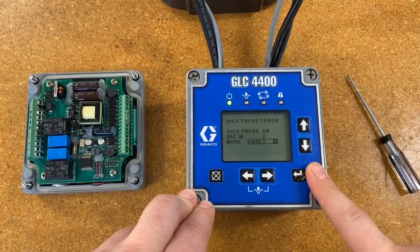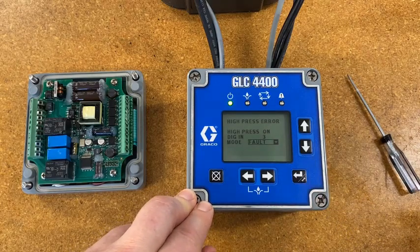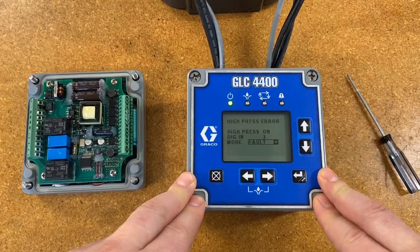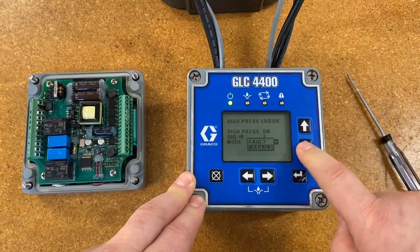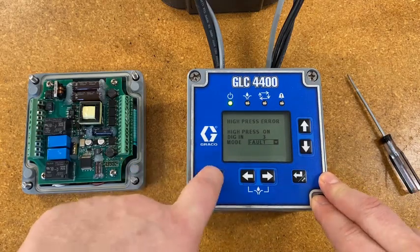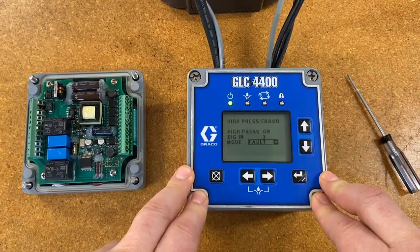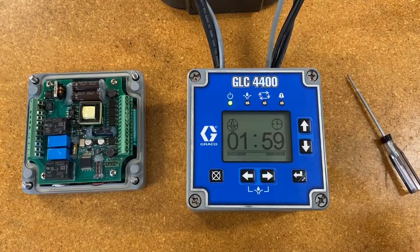We've got three selected, and here you can decide if you want to go to a warning or a fault. The warning is a little more subtle and the system is going to keep working. Typically you're putting broken line indicators on really important, critical lubrication points, so if that line breaks you probably want to know right away and take corrective action. You still have the option to change it to a warning, but I'd suggest changing it to a fault unless the warning fits better into your application. Once we back out of that, the settings are saved — digital input three, fault mode. Now we can back out and that's really all there is to it.